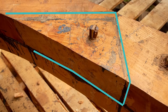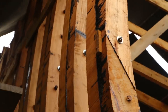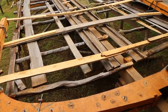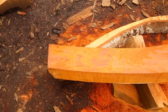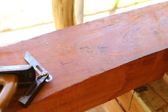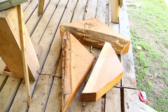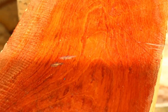Knees or anchor stock are used to strengthen frames. Basically there are some big curves in the ship now. As we're heading towards the midsection, they're really getting a lot of curve in them, and it's difficult to find grown pieces with the grain running all the way through, which is the most desirable. The anchor stock is basically a remedy for short grain or a lack of the desired curve, and it provides strength.